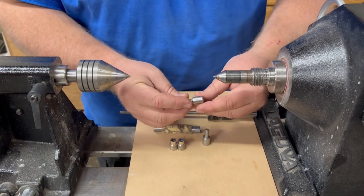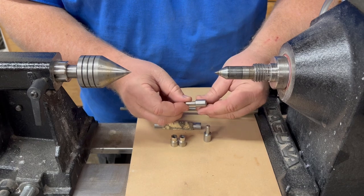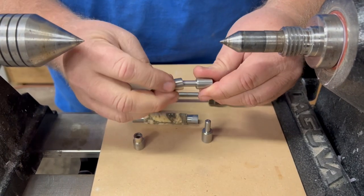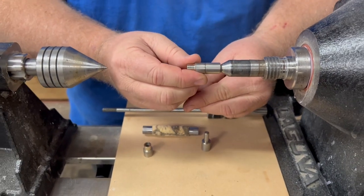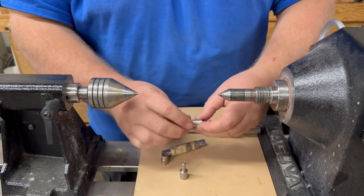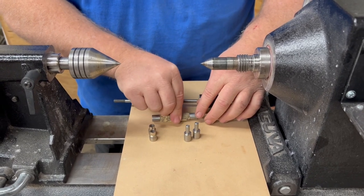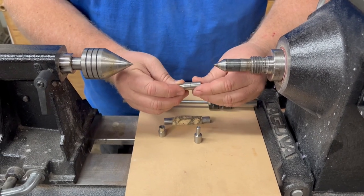What you can use are TBC adapters. These are our top-choice premium adapters — you can see how perfectly machined they are. They act like little mandrels for your bushings, so you can put one bushing between center and the other bushing between center and you've got TBC bushings from traditional ones. I always tell people it's better to get TBC bushings for the kit if available, but a good quality set of adapters works really well.